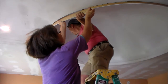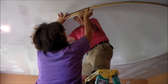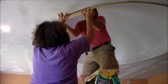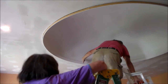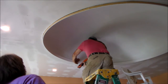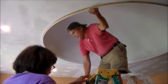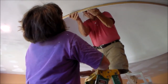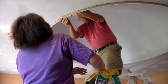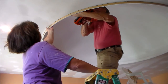The first piece of casing being installed is the widest one — this is three inches wide and it's either a door casing or a baseboard casing; either one would work fine. I'm having this casing drop below the ceiling level by one inch so that I can attach a quarter round on the exterior part.